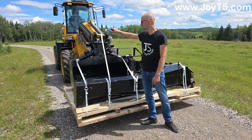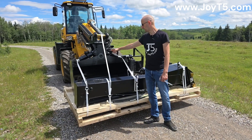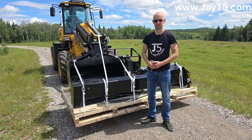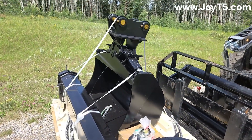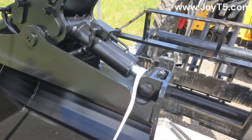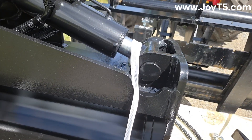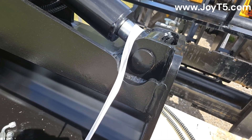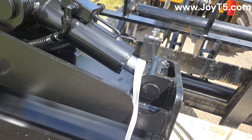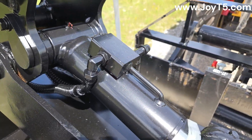The bucket ears are 20 millimeters thick. Also these cylinders have line failure devices that will help you keep the angle of the bucket even if the hoses fail. Here's a close-up of the tilt bucket. As you see it has good maintainability - they even put notches in to be able to take the pins out. Not every factory does that. Every movable point has a grease nipple.